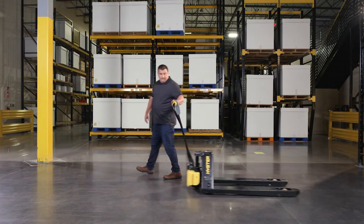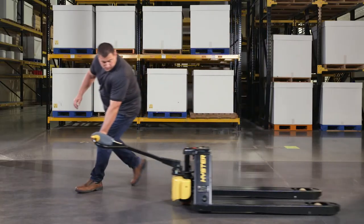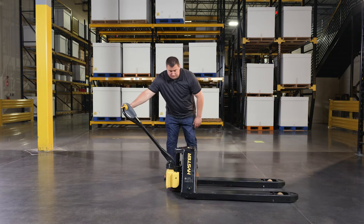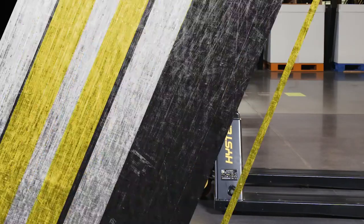To stop the truck more quickly, move the steering tiller to position B, either upright or in the lowest position. In an emergency, the unit can also be stopped by pressing down the quick power disconnect switch, which will aggressively apply the brake.